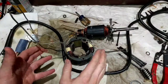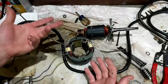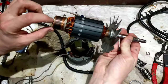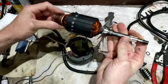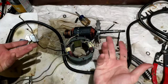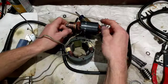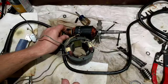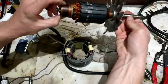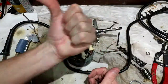So what does all that accomplish? Motors work on electromagnetism. All this electricity flowing here, here, and in here creates a magnetic field. We get a magnetic field in this coil which travels over to the other coil, into one of these, through some coils in here — you can see the ends sticking out — which creates the same polarity opposing. Think back to your high school physics class: the magnetic field here opposes the magnetic field of this other coil, and you get a physical push — you get a force. This coil over here accomplishes approximately the same thing.